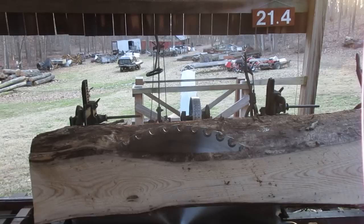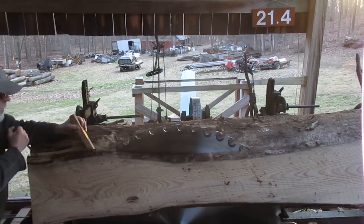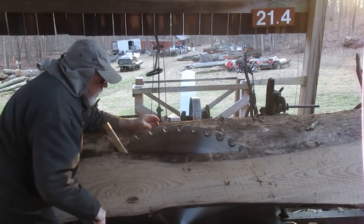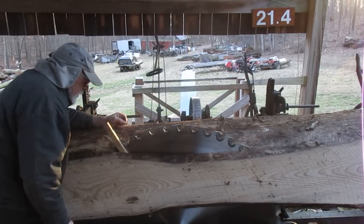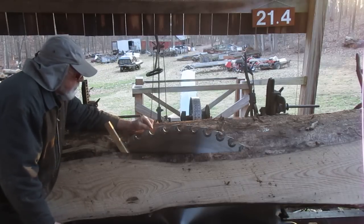I hope it didn't heat that blade up. But it's not pinched. The splitter's got it, but on this side it's a quarter inch away. I don't see any reason for that. Man, she is tight too. Man, you got perfect lead, perfect. The blade isn't touching it on that side at all. Old hard ash, dull teeth.